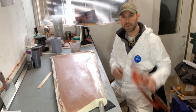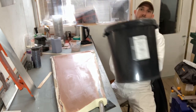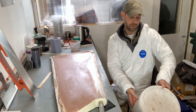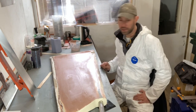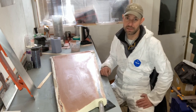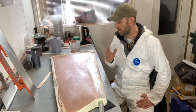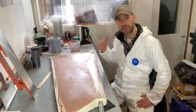The other thing, I can't remember if I talked about what filling material I'm using. I talked about the fact that it's an epoxy. I am thickening the epoxy with 407, I've got a big bucket of it. I'm also using this stuff, which is called Q-Cell. It's a very lightweight filler that is compatible with polyester and epoxy, it says. Inorganic microspheres make it very easy to sand, so I quite like using the two together, because the Q-Cell just makes it a little bit lighter and a little bit easier to sand. Although the low density filler is actually not that hard to sand, it makes life slightly easier and slightly quicker on a job like this where you're not doing a structural filling job. It is just a filling and fairing job, if that makes sense. Right, I'm going to let this set up. I've got some work to do back in the boatyard, and I'll be back tomorrow to continue the fun.